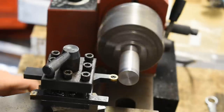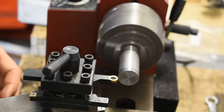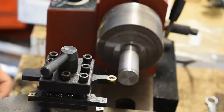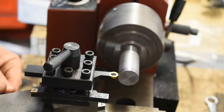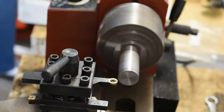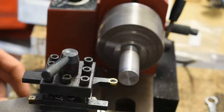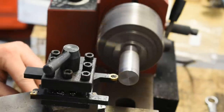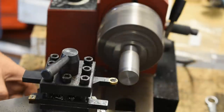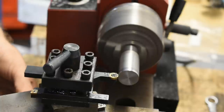So we always feed back and set our zero — I turn this dial to zero without turning the handle. I'll set that to two and a half — wait, my mistake, I have to start over because of backlash. That's what I'm fighting — that's why I have to start over. Now we're going to feed it to two thousandths and feed it in nice and slow, just like that.